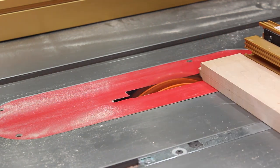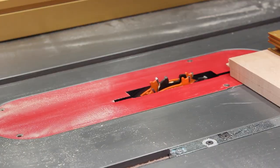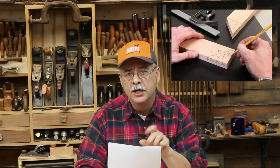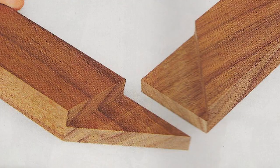It's time for some woodworking tips. My tip this week is on blade setup for half-lap joints. Whether you're using a dado set or just a regular cross-cut blade, you have to set the height exactly half the thickness of your material. The easiest way is to use a scrap piece of the stock you're working with. You raise the blade just a bit less than what looks to be the center of the workpiece, then make a test cut on both sides. Repeat the process, raising the blade a tiny bit at a time until you cut away the last little bit of material and you've got the perfect setup. My tip of the week takes Stumpy's idea even farther — miter joints aren't particularly strong because you're gluing end grain to end grain. So the next time you make a mitered frame, try a mitered half-lap. These provide a long-grain gluing surface and are a much stronger way to get the same look.